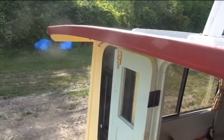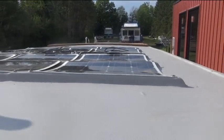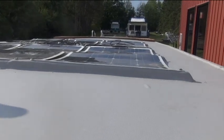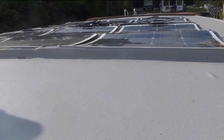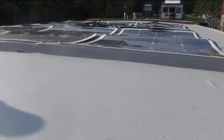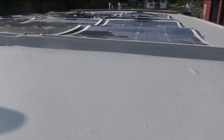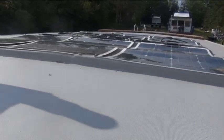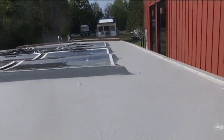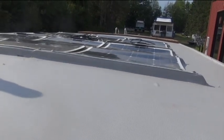One of the things we use on this boat are solar panels. These are flexible — each one is 100 watts, so I've got 600 watts of energy coming out here when the sun is at noon. The price was really quite good. I got these through AliExpress, came from China very quickly, with the controller and the wiring. It ended up being about $750 Canadian — a pretty good deal, given that marine supply stores were asking about $200 for a single rigid panel. All I needed to do was get them up a little bit off the deck, because they do generate a lot of heat underneath when they're working, so you want some airflow underneath.